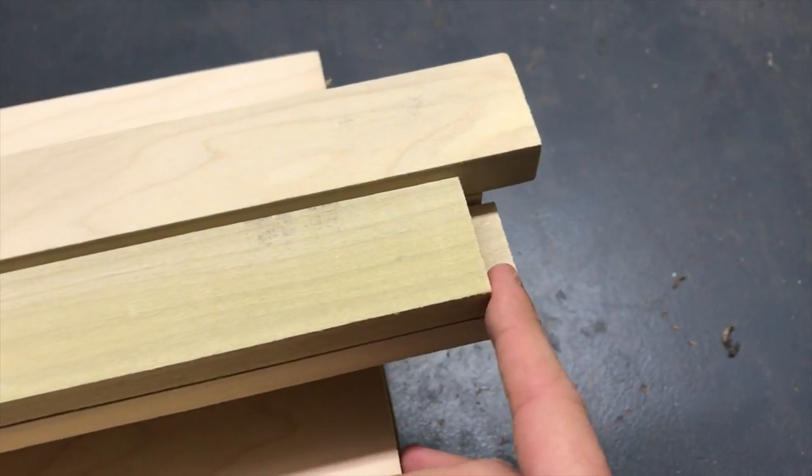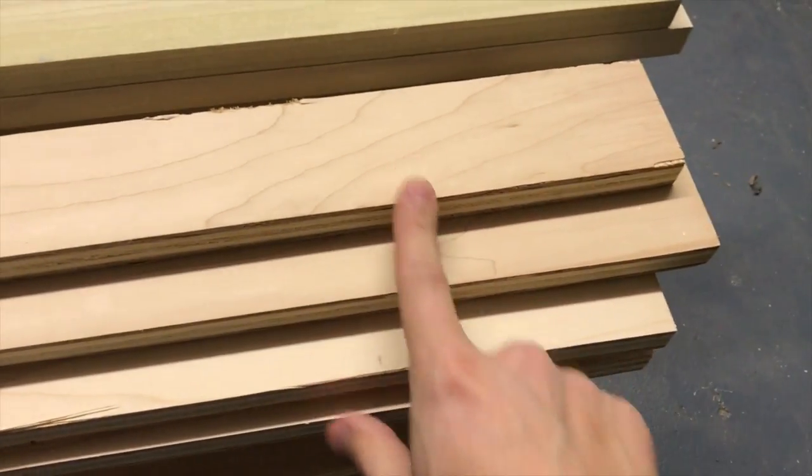To do that, I just got Poplar — it paints up real nice, which is what I'm going to do. I got some one-by-two-by-eights, one-by-two-by-sixes, one-by-four, and that should be enough. The leftover from each of the sheets of plywood that we cut down, which is about three inches, we're going to use as the toe kick to the bookshelves.